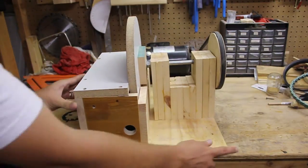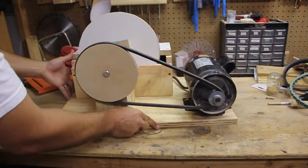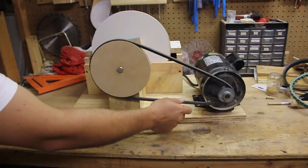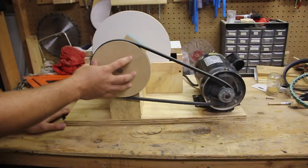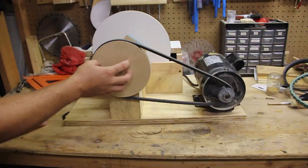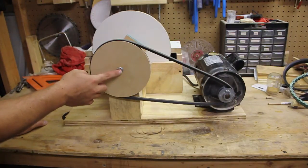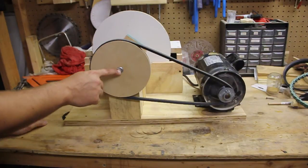I'll start with the back side. This is a one and a half inch pulley. I already had this belt, and then I made this 7 inch pulley on my table saw out of a piece of plywood. I'll put a link to how I learned how to make that in the description. Then I drilled a half inch hole in the middle of this pulley.